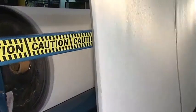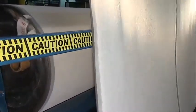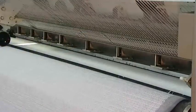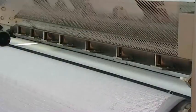The 10th gauge graphics machine can accommodate a variety of yarn types. For cut pile patterns, either staple or filament yarn may be used. Gray goods may be tufted for piece-dyed patterns. This particular product uses two types of yarn that, when dyed, create a solid color background and a multicolored accent. Loop pile or tip-sheared patterns require the use of continuous filament yarn.